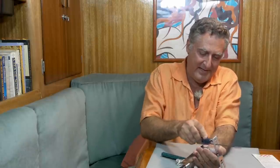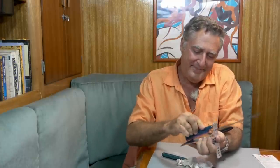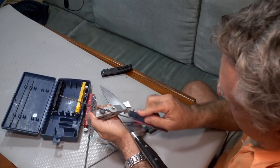This tool makes the job of getting that angle right every stroke so easy that absolutely anyone could do this. In fact, if you wanted to make your own knives — if you cut a vaguely knife-shaped object with a little ground taper to it and then used a kit like this to put the edge on it — you could make a knife out of a piece of appropriate steel. There's a lot to knife making, and if you're into it, you're not watching my video, because there are guys that just worship this process. They'll use some big flat Arkansas stone or something from Japan, but this works.